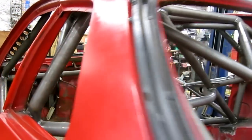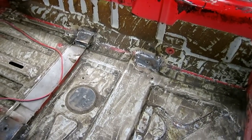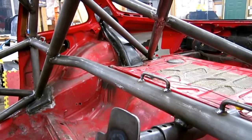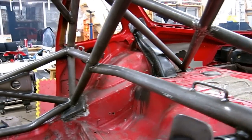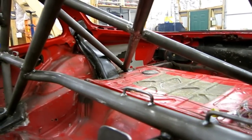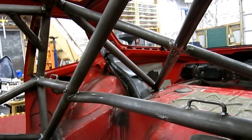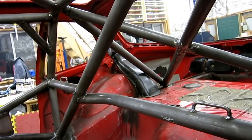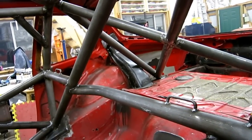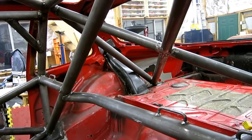For the seat, I actually had to cut the seat mounts out of the floor and lower them down a bit, which is why the driver's harness bar is about an inch and a half lower than the passenger's harness bar. I think that's okay. In an ideal world it would have been nice for them to meet at that joint. These harness bars don't provide a real stiffening or triangulation effect to the cage, so it's less important that they join at the node.